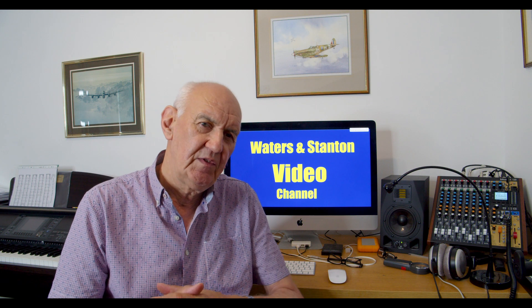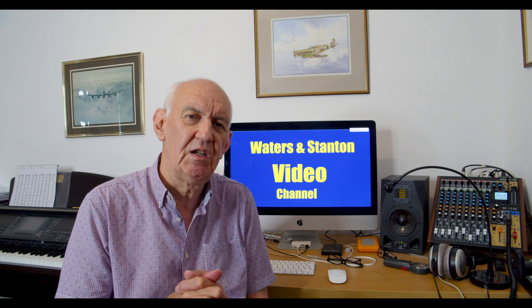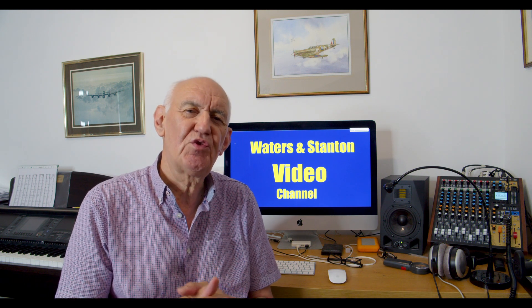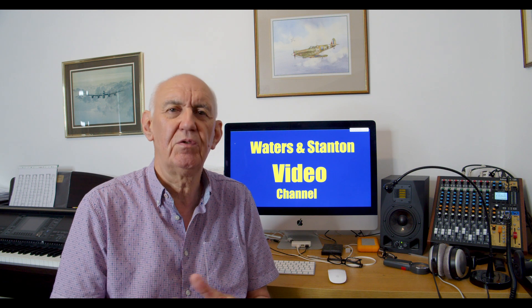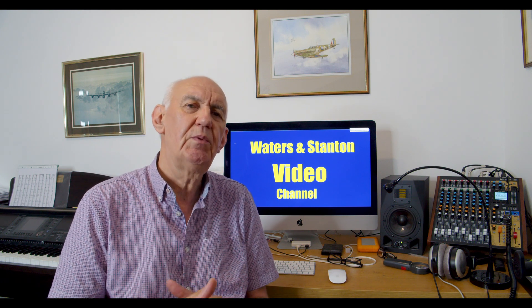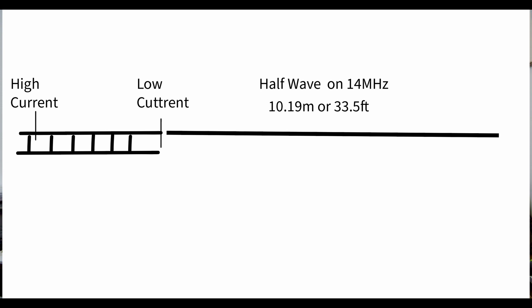I'm going to go back nearly 100 years to the days of the Zeppelin. This principle was used in the Zeppelin antenna — hence the name Zepp, or end-fed Zepp. It's the way they trailed a half-wave antenna out of the balloon. If you feed an end-fed wire you've got a very high impedance — very high voltage and very low current. On the screen you'll see that if you add just a quarter wavelength of balanced feeder — in this case 450 ohm ladder line — you then arrive at a feed point which is the maximum current point and minimum voltage, making it very easy to feed because it's a low impedance.